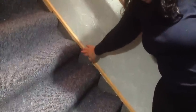This is our finish. I added that piece of flexible molding. I tacked it in with some finish nails and finished. And this is the wall that we did with the tissue paper and paint. We painted the wall first, put the tissue paper on, and the paint was like a glue. So we just went over it with the paintbrush, and then we did the entire wall, all the way around here. So this is what our section now looks like.